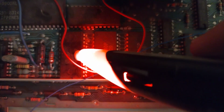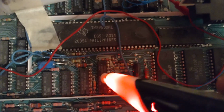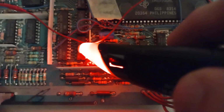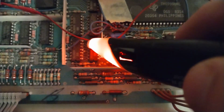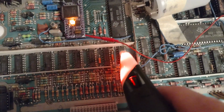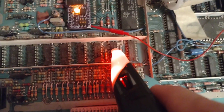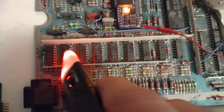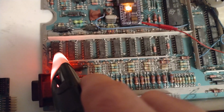We're just sitting at the master title page here. There's nothing special going on. Let's look at the CPU. Oh, we'll come down this support circuitry. Parts of the multiplexer. Not much, really. This red wire is an audio cable for the F18. We'll get to under the can in a sec. How about the VDP RAM? Well, it's not being used in this console. So there's no refresh happening. So I would expect these to be noisier on a real machine.